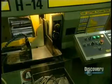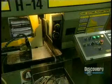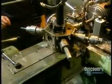Elsewhere in the factory, a semi-automatic saw cuts flat bars of steel. These bars will form the frame that will surround the steel plates. Meanwhile, another machine, called a turret, fashions steel bars into moving parts for the locking mechanism, and also into hinges.